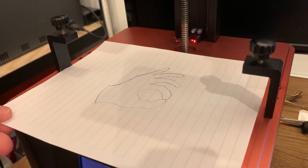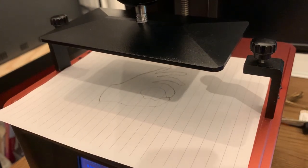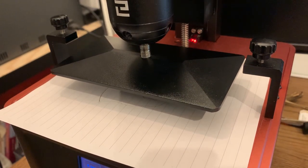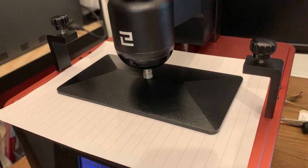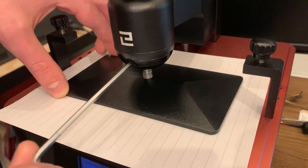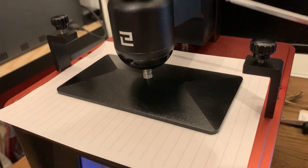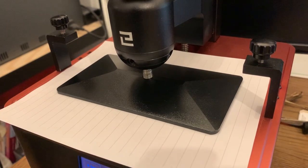Without the tank, place a little piece of paper on the screen and let the build plate drop down. Use the procedure in the machine's menu — the build plate will drop down, make contact, raise up, and go down again. Once it's stuck in position, carefully rotate the build plate to center it properly, then screw and lock it in the right position. After that, the build plate is correctly leveled — that's pretty much it.